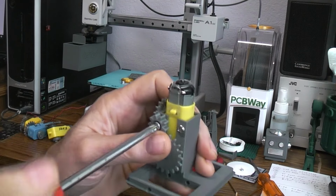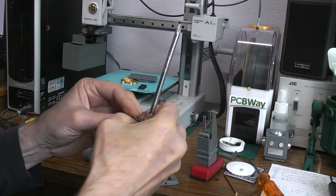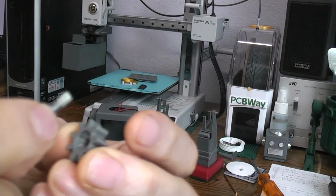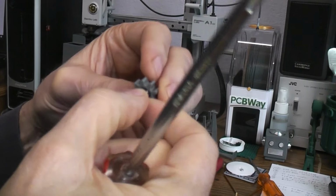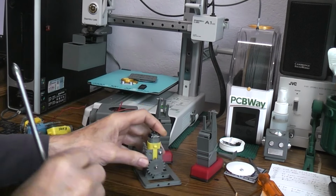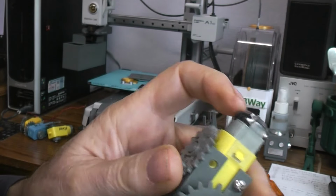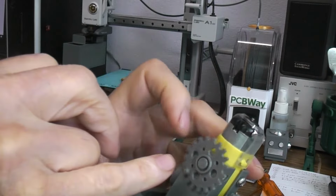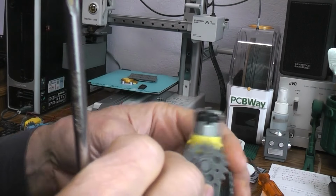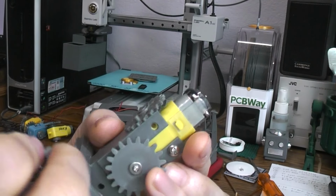And again, you can use a 1/2 inch 6-32 screw or whatever you've got laying around. Whatever screw you end up using needs to be able to spin free in this hole. This actually looks a little bit longer than half. As you can see, as long as it'll spin on there free, you're good to go. And it's actually using one of the motor mount holes to hold that gear in place. Then here's this one on the front, which I talked about earlier. It has a post that I glued in. Again, that could have been a screw, as long as the screw wasn't so long that it would start pushing against the motor housing and causing a problem there.